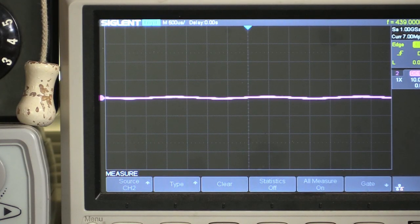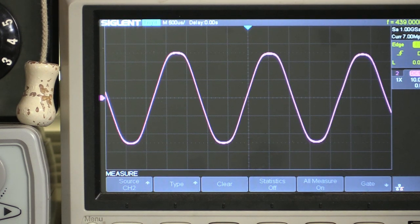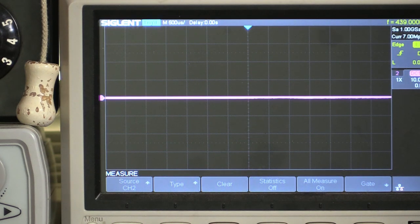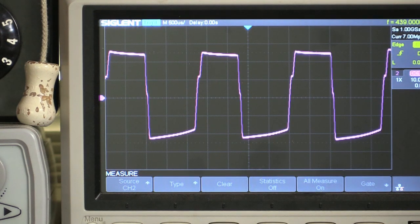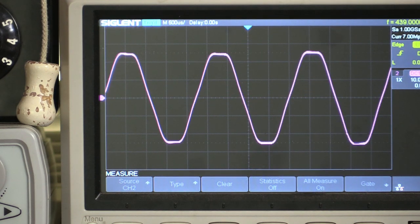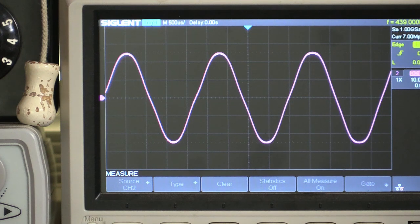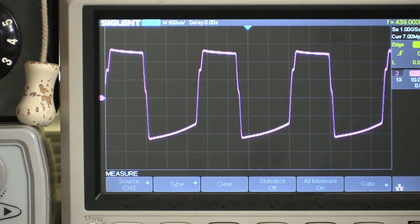Here's our, look at how much lower the low input is. Still, if you're willing to go to 10, it peaks at 10, maximum volume 10 on the low input. This is going to look like some ugly square wave. There it is, with some ringing and all. This, with master volume on full, is reaching maximum volume on knob position 2. So everything after that is just various shades of distortion.